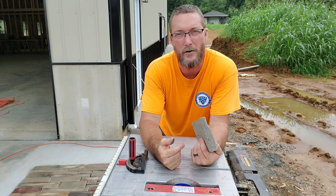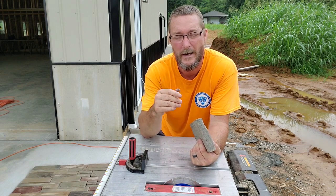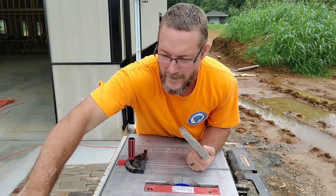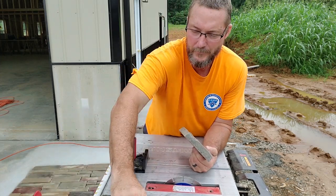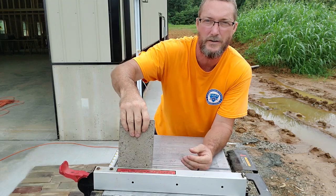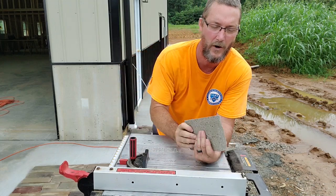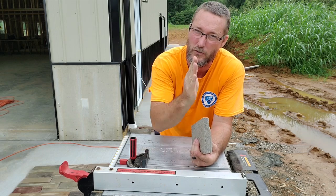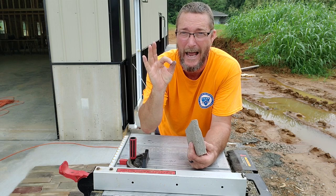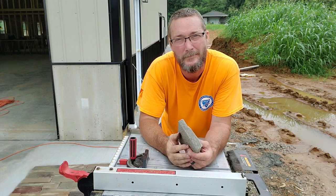And now I'm going to figure out how to cut that little coping using the fence on my saw. I can use the adjustable fence to hold this up against and make those cuts. They'll all be exact depth and perfectly vertical so that they sit good. Should be okay. See how it turns out?